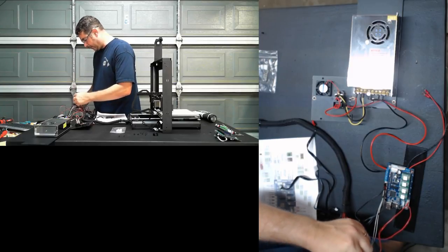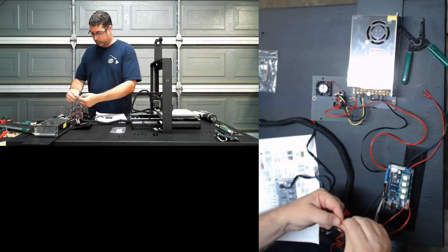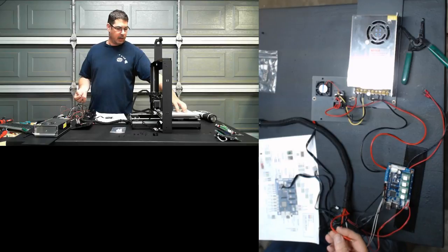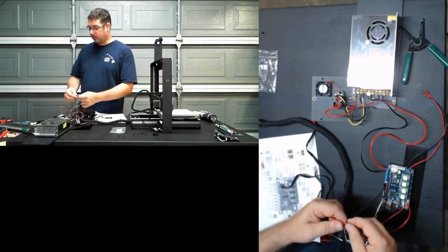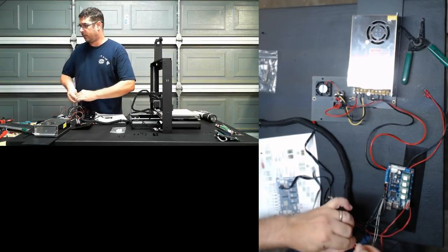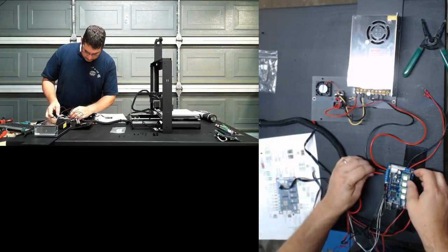I have seen a lot of manufacturers that have not, especially the cheaper Chinese kits. Yes, the Mega Making, the Mini does support heat beds up to a certain size. Ray can answer that on the technical side about how large, but it will support the heat bed on the Di3. Anything larger, for example, if you wanted to use this in a CR10 or anything else, this printer is 12 volts. Anything else you would need to use an external MOSFET, which when given the option is not a bad way to go to begin with. So for purposes here today, we are going directly to the board and using the built-in MOSFET on the board.